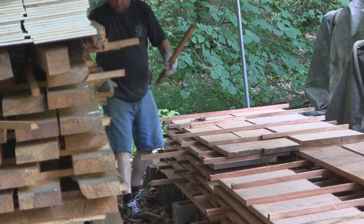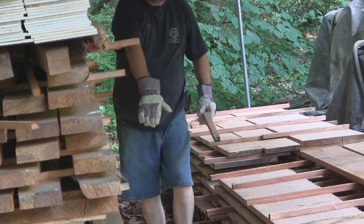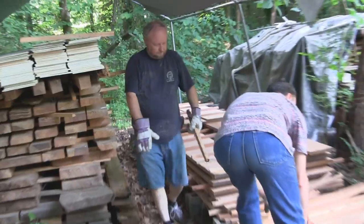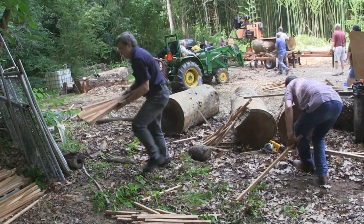But if you don't have that whole area completely flat, you'll program into the wood that bow or whatever you've got. It's got to be flat across and flat on the long plane too.